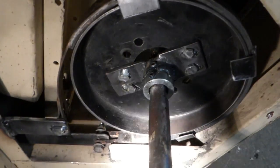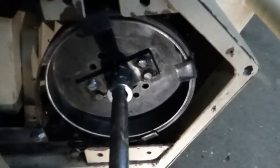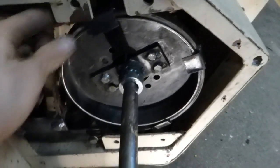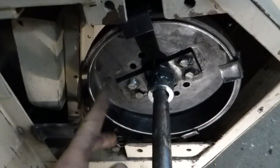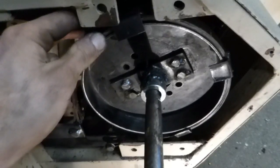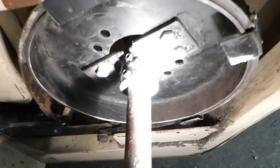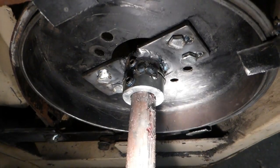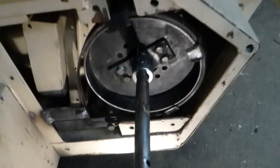I ended up just driving it back because it didn't fit on the trailer, but I got it all fixed up. I put a bunch of tabs on here to keep it centered. I think it came off because the set screws loosened up and it moved over and fell off. So I welded on an extra collar here to give it more support — now it's got four set screws in it and a wider collar. I think that'll do it, so I'll give it another try.